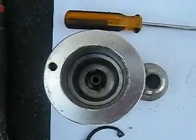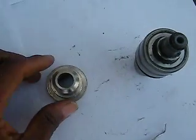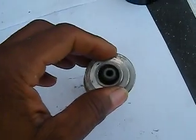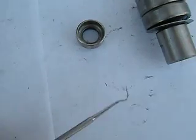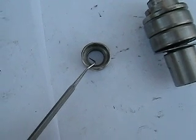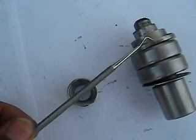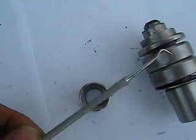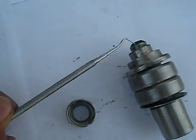So that's the inside of the housing, and these are the other two components inside the housing. Okay, this portion, if I was to reassemble it on the outside, this ring would go on top here like that, and this is another ring that contains an O-ring on the inside there. So what that does is contain the water, when the mechanical seal is leaking, from entering the shaft along this portion, coming along the shroud. And then there's another O-ring on the outside to prevent water from entering along between the housing and the bearing, and this O-ring here prevents water from entering between the shroud and the shaft.